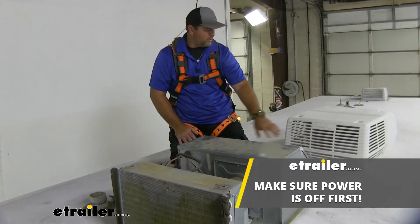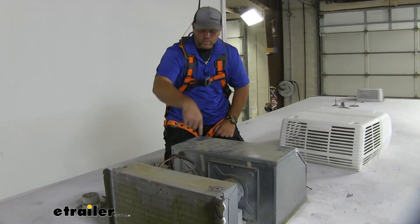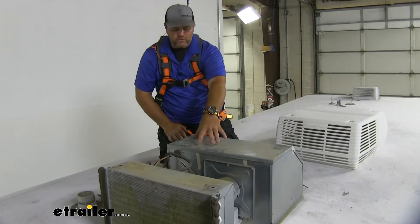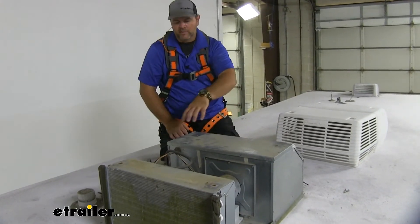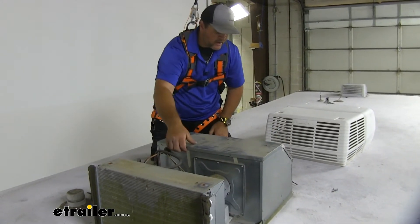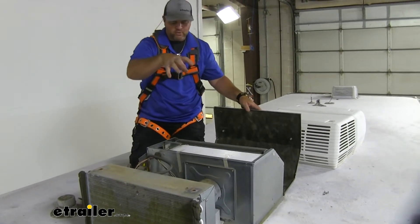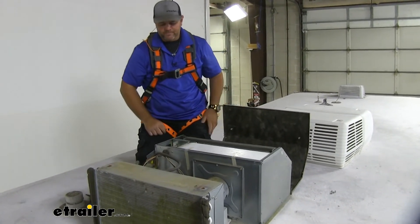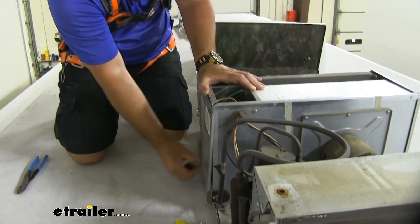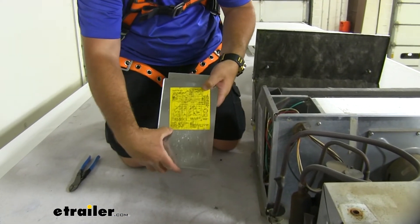To start your installation, we need to come up on the roof. We need to remove our air conditioner shroud or cover — usually just four screws or four bolts. Pop that off, and if you remove this front panel here, it's going to make it a little bit easier to get to the wires. I went ahead and took the screws off — they just run along the side, you might have two in the back. We're going to rotate it forward because our wires we're going to be working with are right in this corner. On the side here, you're going to find a panel. Remove that panel, and what you're looking for is this schematic.